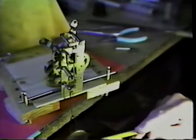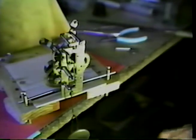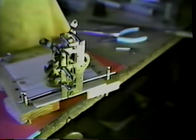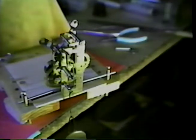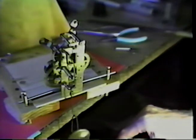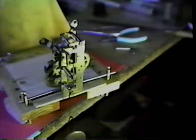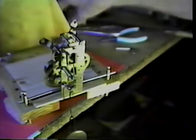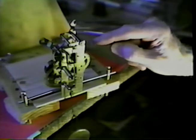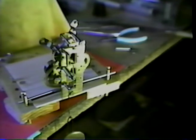This pendulum does not appear to be the original pendulum of the clock. However, I am persuaded that it is approximately the correct length from the count on the gear train, but we're not certain that the movement is on time. Looking down here, it looks like the tip of the pendulum is swinging approximately an inch each way. And looking into the escape wheel here, I can see quite a significant recoil in the operation, and the escapement looks completely in order.